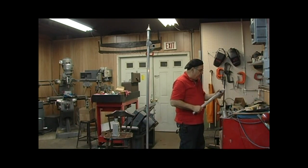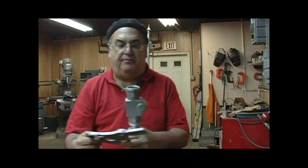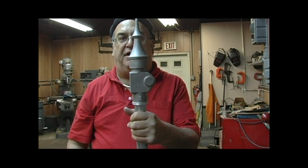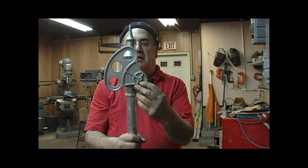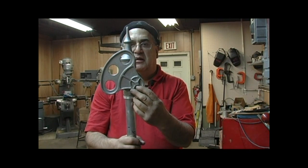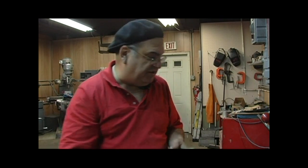I also have the lower quadrant signals, which are cool. Here's the lower quadrant — I didn't make a blade for this one, but this would be the head for it. Then you have the old-style finial like this, and it goes over the top — that's how that was designed to go, with a couple of set screws to hold it. It'd be like this — clear — red — and back to yellow. You might notice — somebody might notice — that this is backwards. The pattern maker who made this for me made it backwards; this rim was supposed to be on the other side and flush. So I've filled that in for now and I'll fix it later.